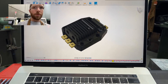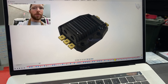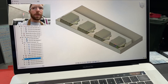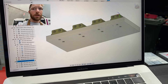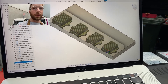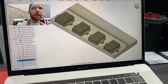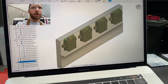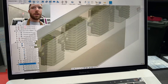This here is what I'm hoping the final heatsink will look like. The base is actually going to be just printed from PETG material and this will be the aluminium part which is anodized black. I've made a fixture to hold down the stock and hold the parts from the backside — they'll be held in place by some M3 socket cap head screws. I'm going to adaptive clear them out, do finishing passes, chamfering, and countersinks in this orientation, and then hold the part in the vice vertically to come in with a slitting saw to create these fins — 1.5 millimeters tall with a 1.5 millimeter gap.